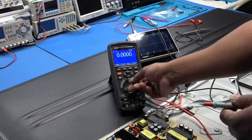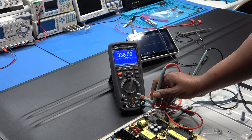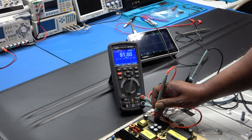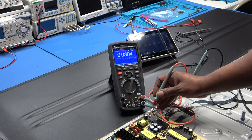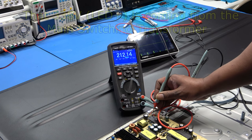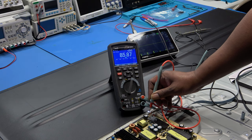Switching to DC volts - the drive pin is at 212 volts. Let me go back to the drain pin: 91 volts at the drain. By the time it gets out of this transformer, with the connectors in series, we get 338 volts at the high end, 212 volts in the middle, and 90 volts at the return line - the negative line at the end of the other strip.